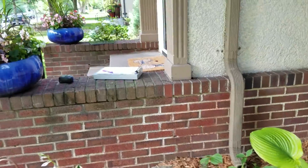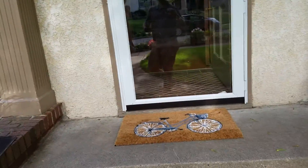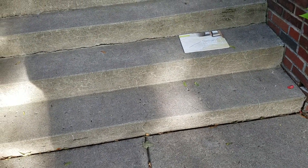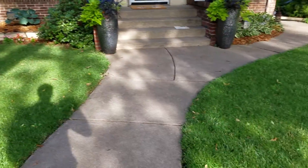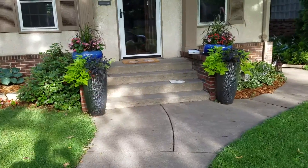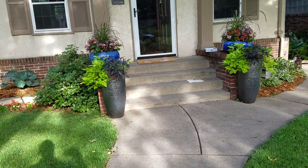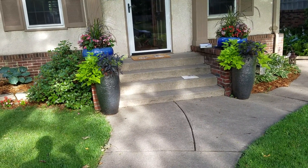Currently the landing is two feet five inches, so we need to stretch it seven inches this way — meaning we need to make a cut in the sidewalk. This is a pretty straightforward step. It doesn't look like the foundation is compromised since the step is pretty level. Do the foundation as a line item as opposed to including it in the bid itself.